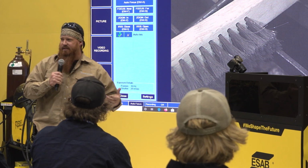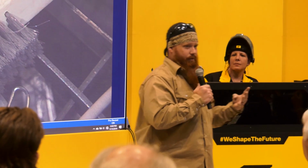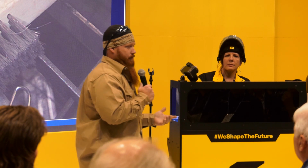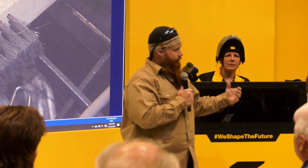So what are some of the disadvantages? Shielded metal arc welding is about 60% electrode efficiency, meaning I'm losing about 40% of that electrode to slag, weld spatter, things of that nature. So there are some drawbacks. It's a slower process.